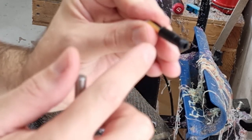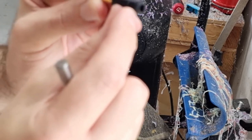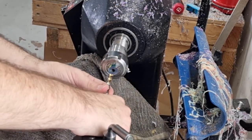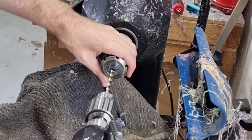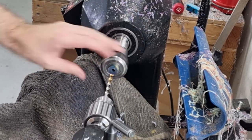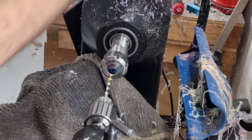We need to drill a hole from the very top here down to just past where the threads end. It doesn't matter if we go a little bit further past, just make sure we're covering that thread area. I've marked on the drill bit where to stop. We've already got a 7mm hole through, so we're drilling back the other way with 7.3mm — we're really only shaving a small amount off the inside, not making it much bigger. Lathe at 175; this one's not too critical if you go slightly too far, just make sure you've covered the thread length.